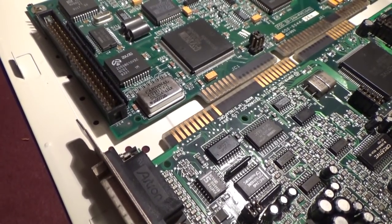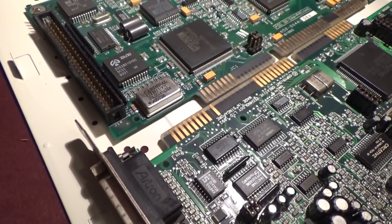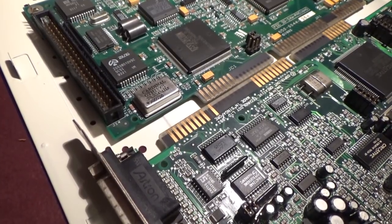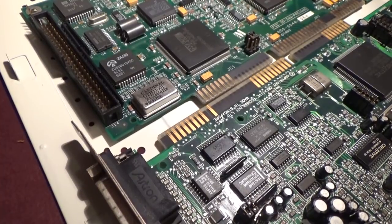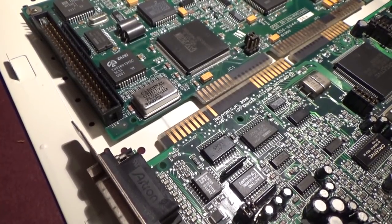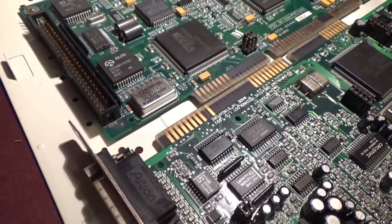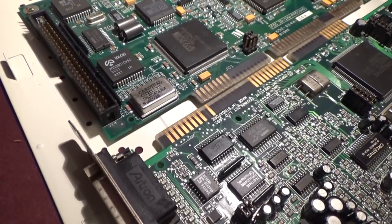I think it's 14.32 MHz, I think it wants, the 262. And supposedly it'll change the pitch slightly if you move it, at least if it's anything like the 2151 that the DX100 uses, which is more like the 2612 that's in the Mega Drive, in effect. But yeah, I'm getting way too nerdy, I think, even for this channel now, so I'll stop.